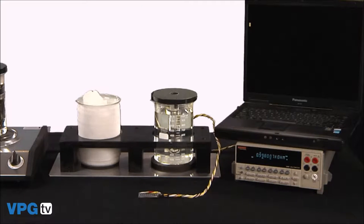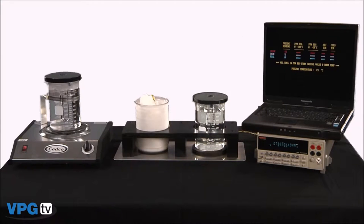These units and a thermistor are wired four-terminal into a Kelvin scanner and precision DMM that is coupled to a laptop. The system will continuously scan the resistors and thermistor, recording their change in resistance and temperature.